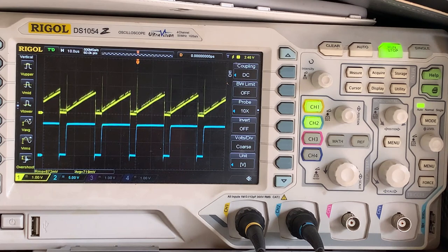What we should have used is the, what do they call it, have I lost it now? It looks like it. What we should have used is the peak forward current, 1/10 of the duty cycle, 0.1 millisecond pulse width, which is 180 milliamps.